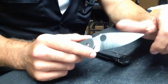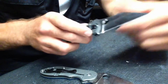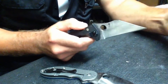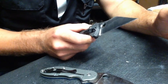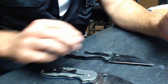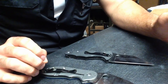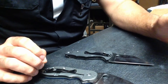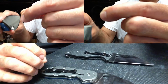So I decided to test the knife. This is a Spyderco Sprint Run Yojimbo 2 in S90V, also reprofiled to 30 degrees inclusive. I sharpened both knives on diamond and ceramic stones. They were both stropped, taking the strops up to a 0.1 micron strop, or 200,000 grit. Both with a coarse finish.